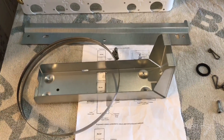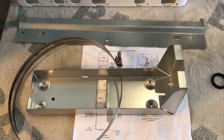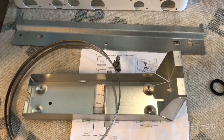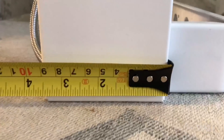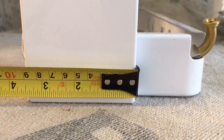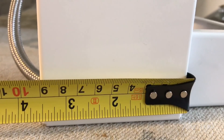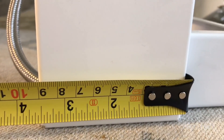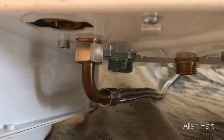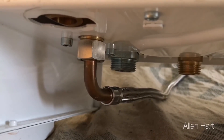You can get a remote expansion vessel kit so the boiler will connect straight back to the wall, and then you can use this bracket with the strap with your existing expansion vessel. By fitting the remote kit you can save about 90mm from the depth of the boiler, which will then make this a cupboard fit boiler — the depth will be about 265mm, so it's very small. Once you have the back jig on the wall, the expansion vessel will connect on this connection at the front of the boiler, making it very easy for the future.